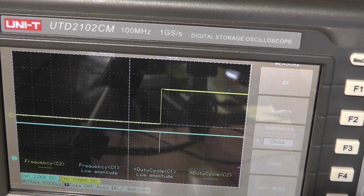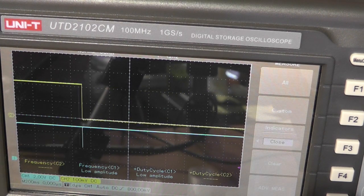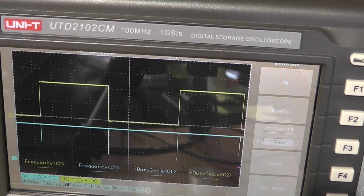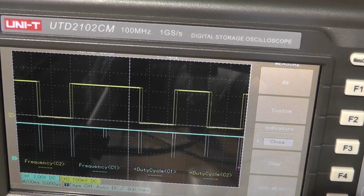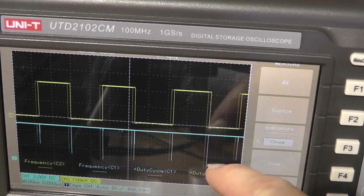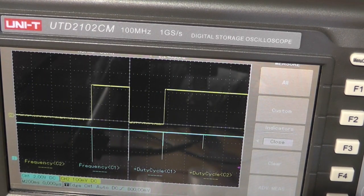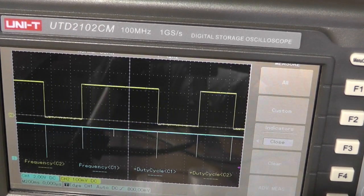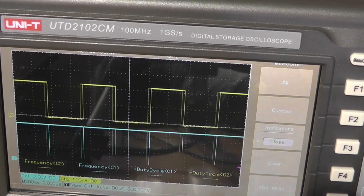So you can watch that single pulse right there. The yellow again is my output to my coil, and the blue little bitty trigger pulse is defining the magnet on the rotor, on the flywheel. So every single revolution I get a pulse, but I'm not doing a good job pulsing this. But every other pulse coming out of the system is divided by 2. Okay?